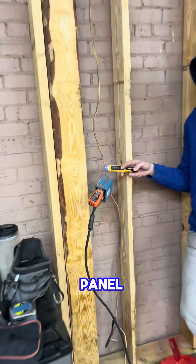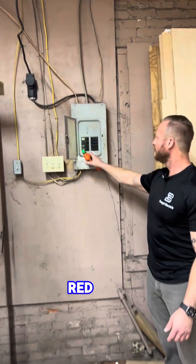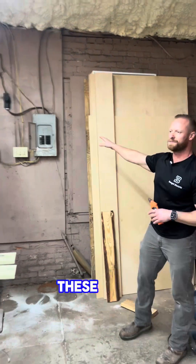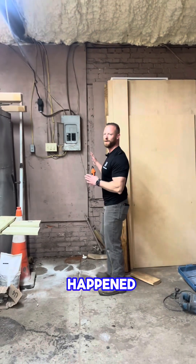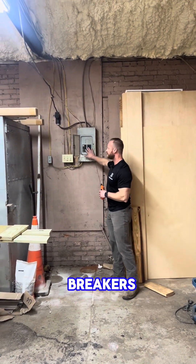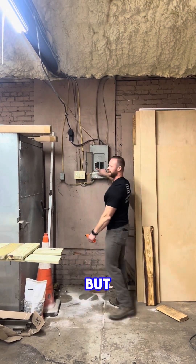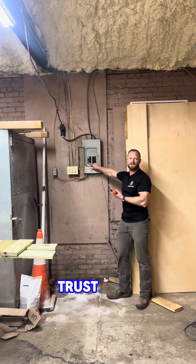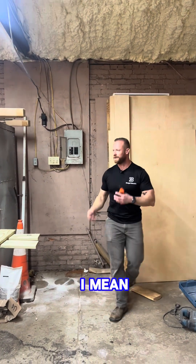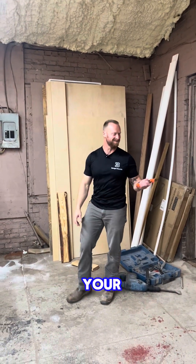Everything's still green on the panel — you can see on here now it doesn't light up red. But the big thing I really want everybody to hear is: when we do turn these breakers back on, it has happened where the panel can blow up in your face. I highly recommend when you're turning these breakers on, always stand to the side. Get as far away as you can because you can't trust these things. It's just a mechanical device — metal, hot metal, arc metal — that can blow up in your face.